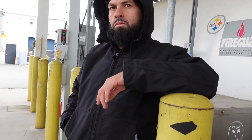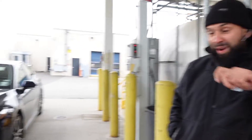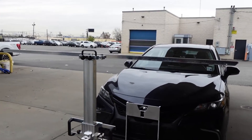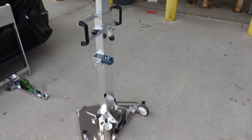What kind of tablets can you use with it? Everything I've seen — Launch, Autel — the G-Scan will definitely work with it. But I'd recommend Launch, because if you're going for speed, Launch scans just the camera — it doesn't scan the entire car. You can pre-scan just what you're calibrating, do the calibration, and do a post-scan. Whereas with an Autel, especially the 908 or 906, they're a lot slower and go through the whole system. If the HVAC system isn't turned off it'll get stuck on that for a minute. So if you can do a one-minute setup and a two-minute calibration, you're winning in under three minutes. As time goes on, we're going to have more and more calibrations — every car we do for the most part, besides a piece of tempered or laminated door glass, has a camera. Times are changing.